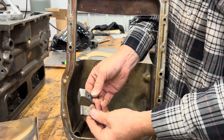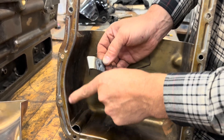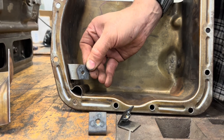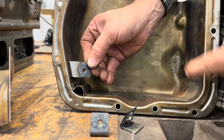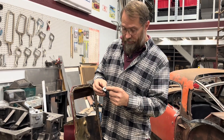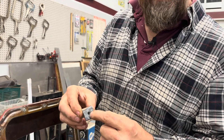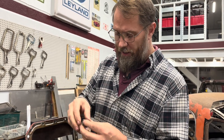The one over here needs to be a little different because of the angle of the pan. There's a 15-degree angle on that, which allows me to put it in there and have it sit square with the rest of them. Whenever you weld nuts into something like this, if you get decent penetration so the nuts are held in properly, the threads will usually get a little bit deformed, so you should always run a tap through it real quick once it cools down.